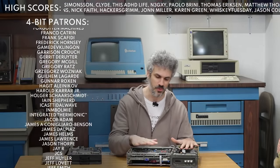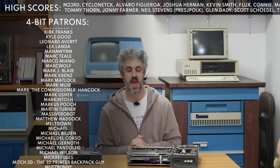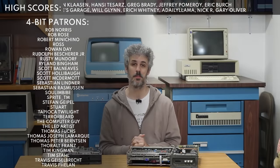We got the 1123 CPU card in and memory card in, and it's on an 18-bit 4-slot backplane. So we have a working 1123 with 256K of RAM. We are pretty much set and ready to go for a portable PDP 11, except we gotta figure out something about the drives.